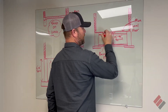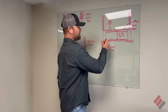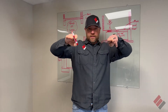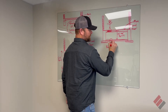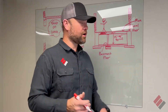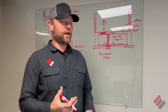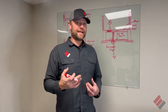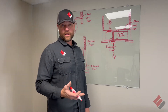These floor joists are going to be holding you up. Sometimes what we see is the wood will start rotting and then it'll start getting a smiley face in it — it'll start sagging. A lot of times there'll be footings underneath with support posts. Maybe they used concrete blocks, which we do see a lot. Maybe they've just deteriorated over time, or maybe the footing has failed and you need a new footing or some sort of support like a pier or a helical underneath it.